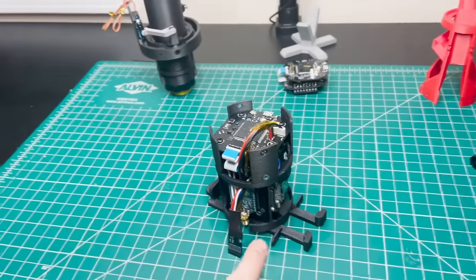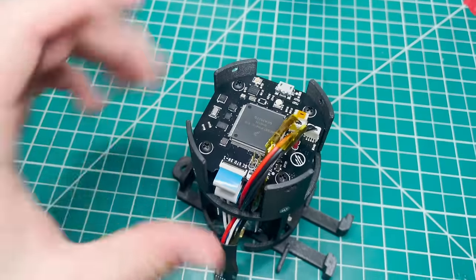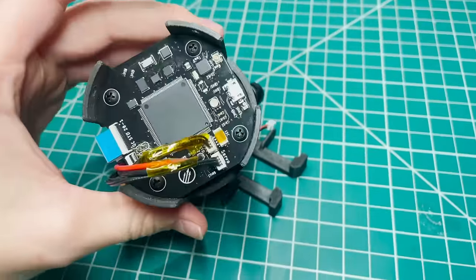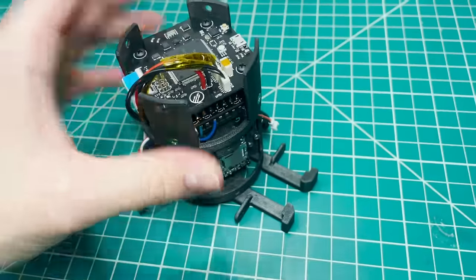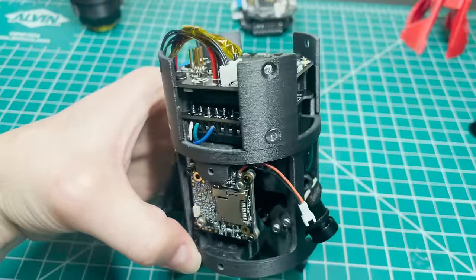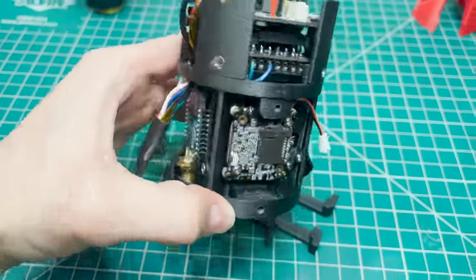And here is our completed lower and middle avionics assembly. So you can see the middle one, we've got our circuit boards in place, both of them. We've got our servo and radio connectors in place. These are for servo power and ground. On the side, you can see three wires in the screw terminals. Those are our pyro positive and then our two pyro minus lines.